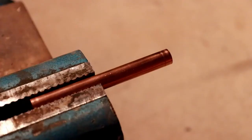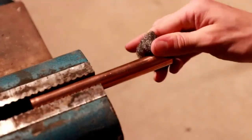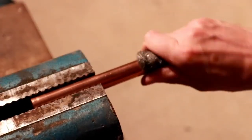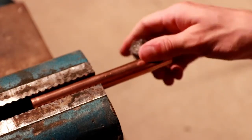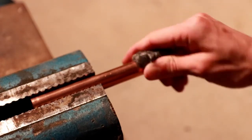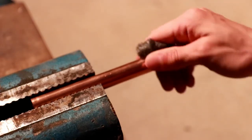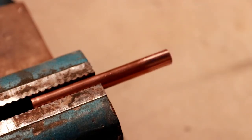So now that I've tested a few things, I'm going to do one more practice run with a confined angle of access to the joint, and I'm going to try that on both sides of this pipe. The whole point here is basically to see if the techniques that I developed with the reach-around method for limited access are going to be viable, and if I can make these connections repeatably. Now, I'm not going to pressure test this one. I'm going to just visually inspect it.